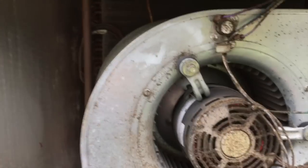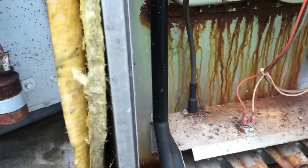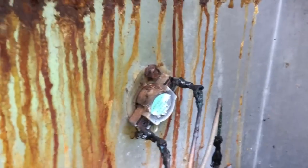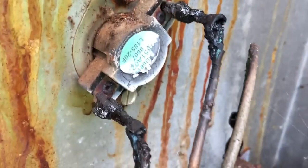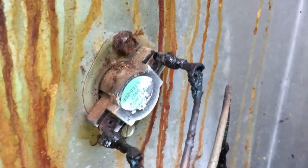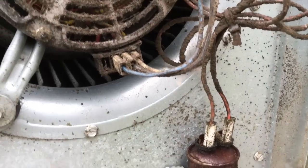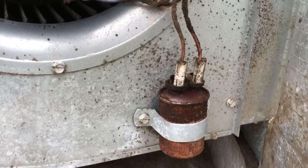I jumped out red and green — of course the blower didn't come on and we know it's because of the capacitor. I jumped out red and yellow just to see if the compressor and the condenser motor would start, and it did. Look at this — we got some more problems here: nice and toasty wires here, we'll have to redo all that. So first thing we'll do is change the capacitor out, put the blower door back on, and get it running in cooling mode.